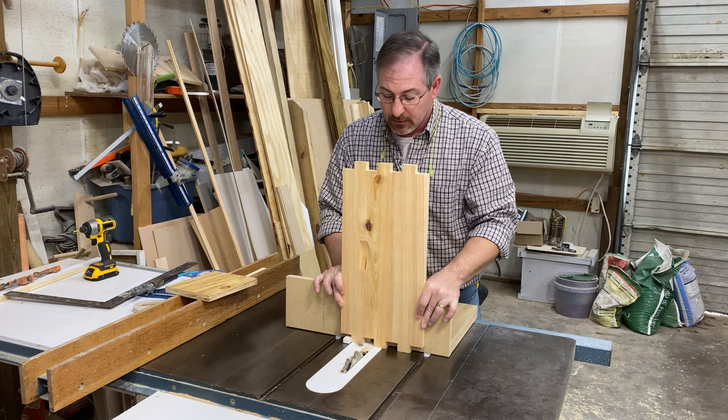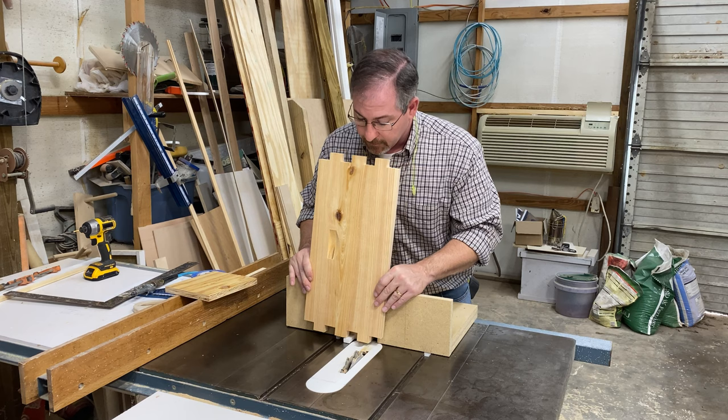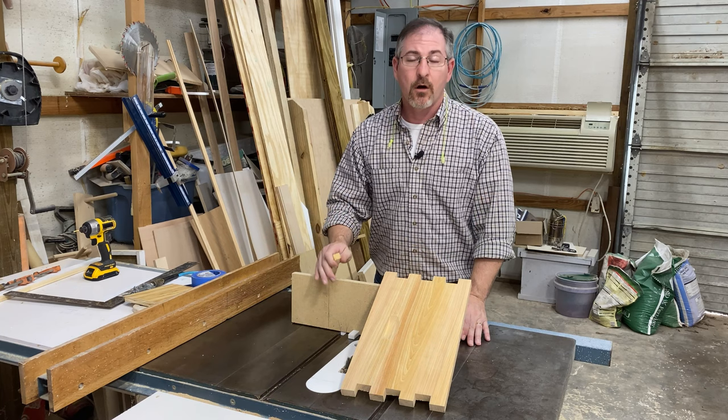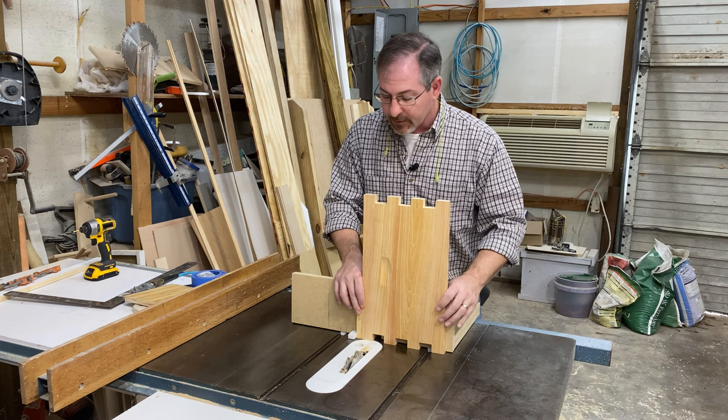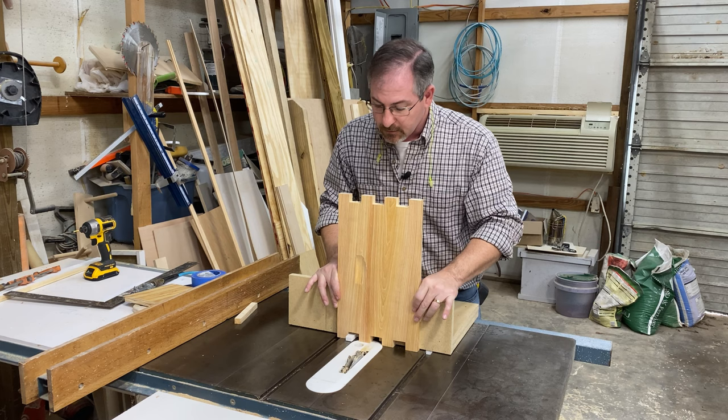From that point on, we'll use the outside edge of our reference peg for our first pass, inside for our second pass, and repeat. For our fronts and backs, we'll take a 5/8 spacer, bump it to the peg, and make our first pass. Then we will bump our panel all the way to the reference peg for our second pass. Then we'll bump to the outside edge, inside edge, and repeat.